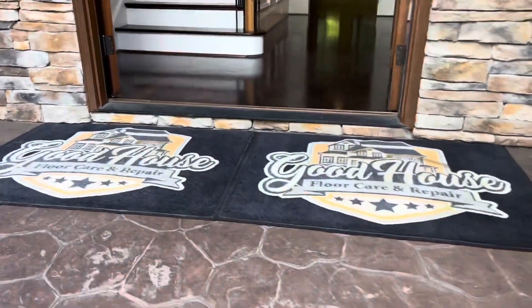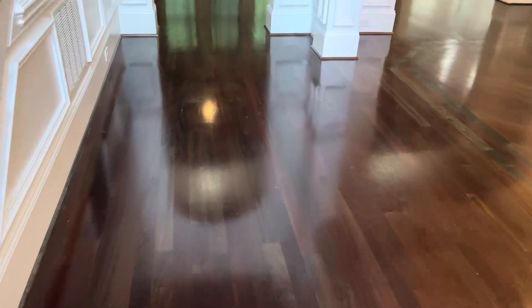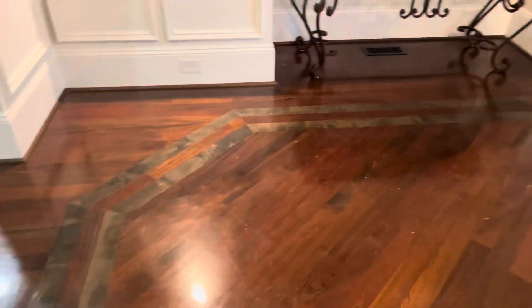So let me show you what I'm up against today. Somebody went ahead and put wax all over these floors, which I don't understand, but I'm going to educate my new clients on how to maintain these floors. As you can see, I came out here about two weeks ago and did my little demo. You see where I removed the wax right there. You can see all these topical scratches that are in the finish here. Now this is a screen recoat — it's not a full sanding, but it will be an improvement.